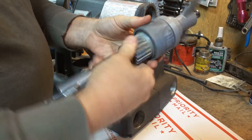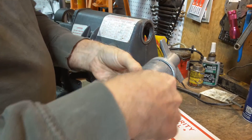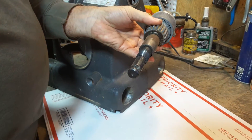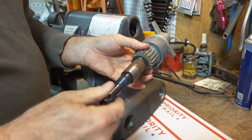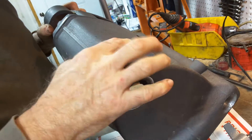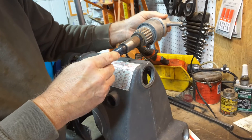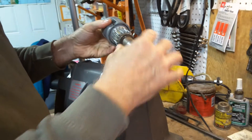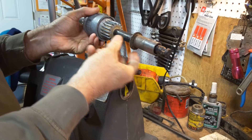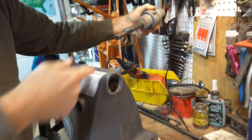But frequently the spring is broken or detached, and I'm going to show you some tips about that. To remove this whole thing, first you have to take off the front pieces — just the big wing nut here. Then you can take this out, a little lock washer. This will still be in the headstock. There's a set screw on the top here, buried under putty, so you'll have to dig the putty out and loosen the set screw. Then you can tap the shaft back and out. You might get caught up with this domed washer hitting this little spline here, so you have to let it go over to get the shaft out. Then you'll end up with these two pieces loose, and the shaft comes totally out.